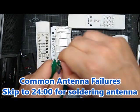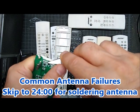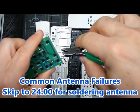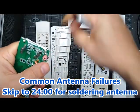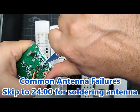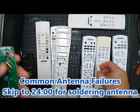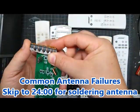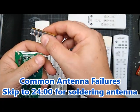I'm going to clean the glue off. If you use an X-Acto knife, you could scratch the circuit board, although there's nothing too important up there. We need to remove it around the solder points. The silicone, as far as I can tell, did absolutely nothing — it can still vibrate a little bit with that glue there and breaks off inside. Most of the time I only see one side broken off. I've seen people try to fix this by unwrapping one wire to make extra length — you can't do that. This is a tuned antenna; we don't want to mess with the wires at all.